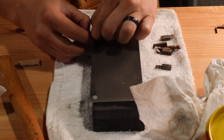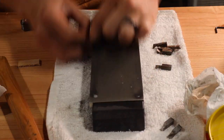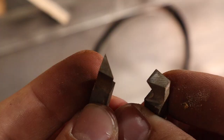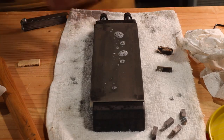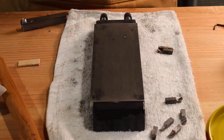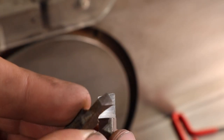Sharpening with the diamond plates is the same as any other sharpening: there is one face that you're trying to get flat, and then every other face should come into it with a perfect sharp edge. The fine cutters were a little more difficult because they have to stand up on end. The rough cutters were a little easier because I could use the natural 90-degree corner on my diamond plates to get those done. Here's another quick view of those brand new beautiful surfaces.